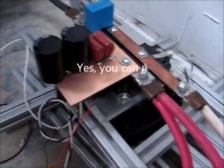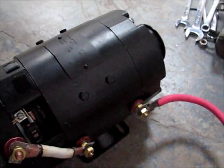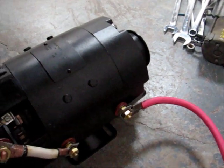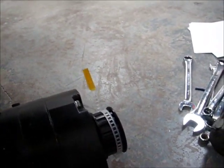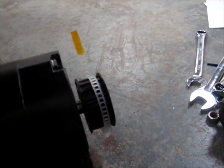There is an awful whine coming from both the controller and the motor. That's because I'm switching at 5 kilohertz, which is a very good frequency for humans to hear. To try and make the rotation of the motor look easier to see, I wrapped a piece of strapping around it so we should be able to watch the motor spin a lot more easily.